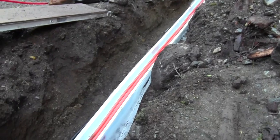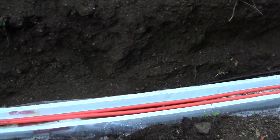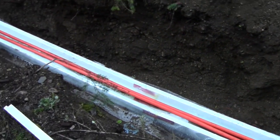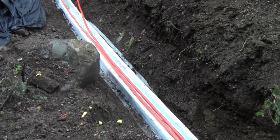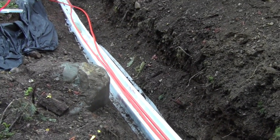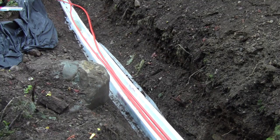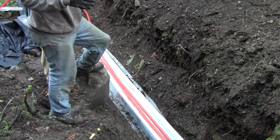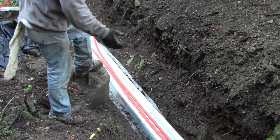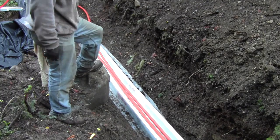There are four pipes in this channel to go to and from the boiler. Right now I'm just getting the PEX straight. The kind of PEX we're using here is called PEX-AL-PEX, and it's got aluminum inside the pipe. I like this stuff — I've never worked with it before until now. Unlike other PEX that stays coiled up, this PEX actually bends and retains its shape.